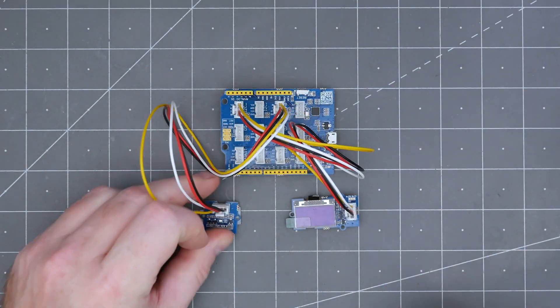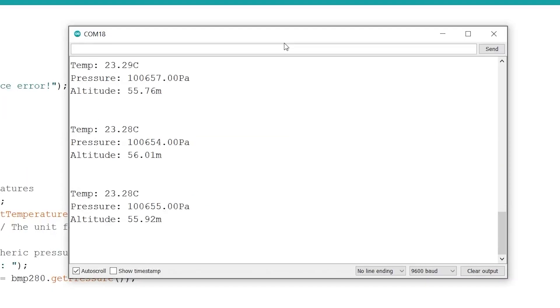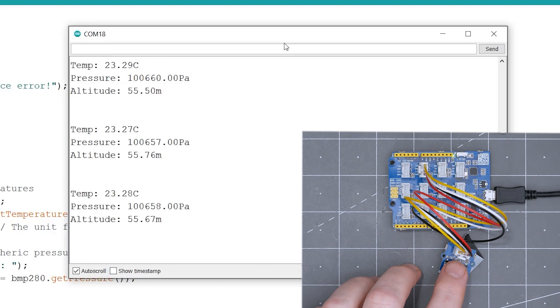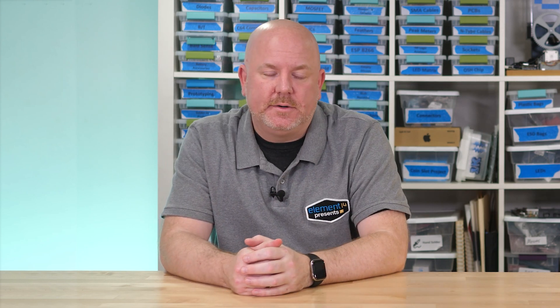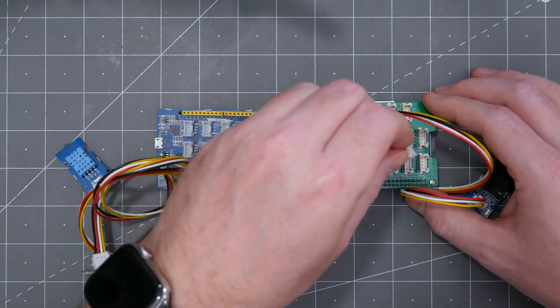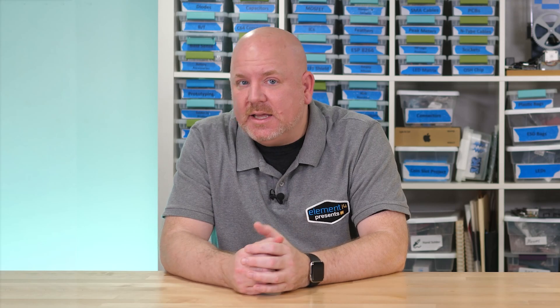The good news is the barometric pressure sensor works fine with their example. I uploaded that and got a readout on the serial monitor, and I verified the sensor is working by using my finger to cause the temperature to go up. So I got at least that much working, and no soldering was required. One advantage to a solution like this is that you can easily move the hardware from one platform to another, but don't forget you have to consider the code — the Arduino is mostly programmed in C, while for Raspberry Pi most of the stuff is in Python. So let's go talk about that Pi hat real quick.